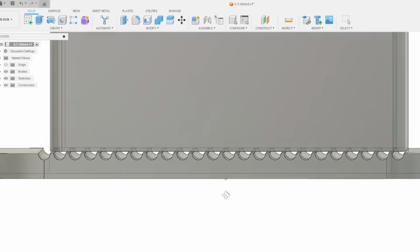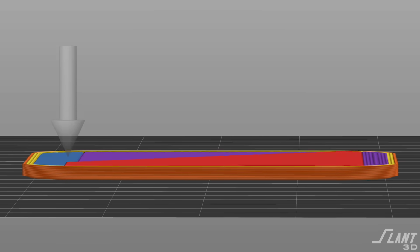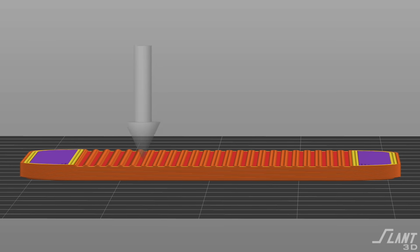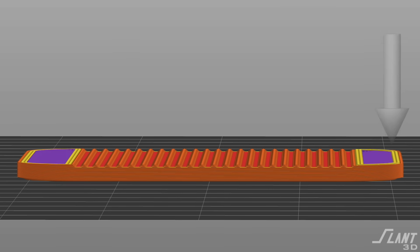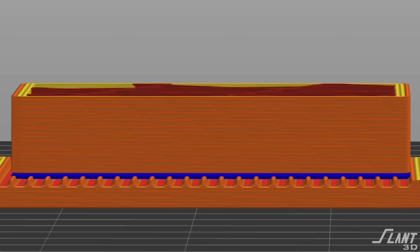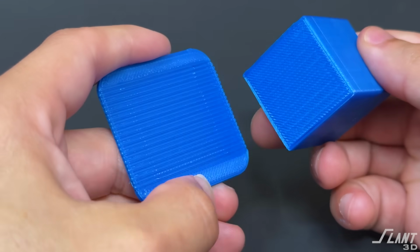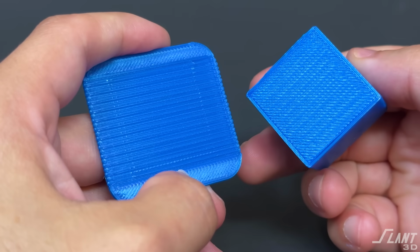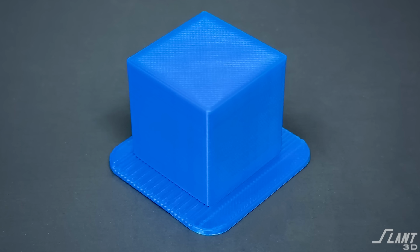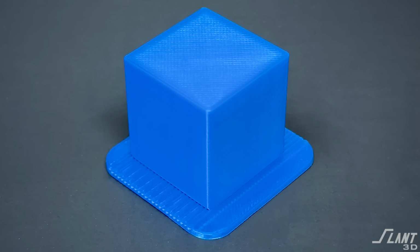So you can do a hemisphere, make sure that the tips of the spaces in between the hemispheres are one layer thick, which means 0.4 millimeters, or maybe 0.5 if you want to stretch it up to, again, make sure it auto slices well and it's not like a thin wall that's ignored. But then you can have that whole row along the bottom, and then the part will break away from that whole row, but still have really, really good adhesion because it's effectively the same part. That lets you connect the piece more tightly to the raft, but still be able to break it away.